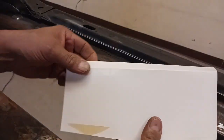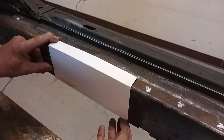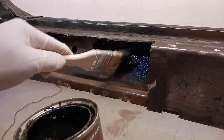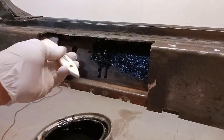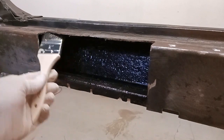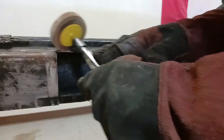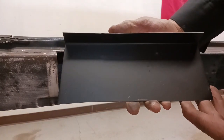Let's check our fit — we're good to go. We're going to get this transferred to metal and get it cut out. Then we're going to apply POR-15 to the inside. Nobody's ever going to know, but I'll know. So we're just going to do the best, most professional job we can. We're going to apply it to that lip there as well. Once this dries we'll be able to weld through it — I didn't put a really thick coat on. We're going to get the area cleaned up with a flap wheel. I've already applied POR-15 to the inside of the donor piece.